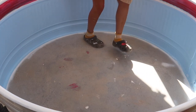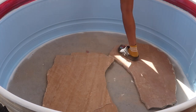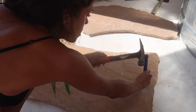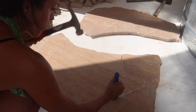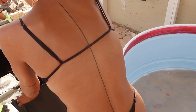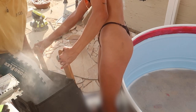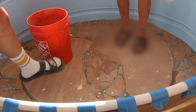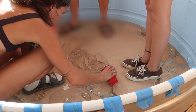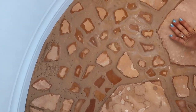People probably skip putting stone at the bottom of a stock tank pool for good reason, but I said let's just go for it — though I should have waited to install the floor after I did the tile, little fun fact. I started putting down some flagstone to see what two pieces would fit, cut it down, mixed up the concrete, and immediately placed it. To break the stone, you just get a stone chisel and follow the line you want to cut multiple times and it cracks naturally. A tip: I would have mixed self-leveling concrete with the grout color I wanted, poured that into the base, and then propped the stone on top, because I had to go back in and grout around my over-mixed self-leveling concrete, which made my life way rougher.